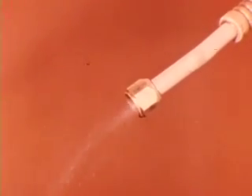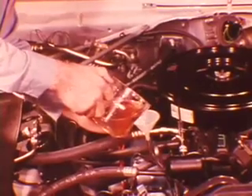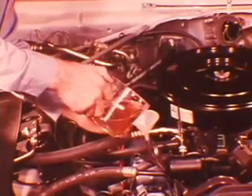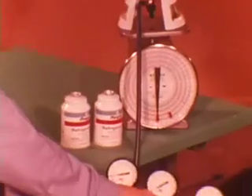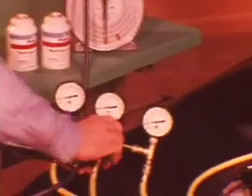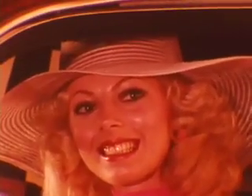After reconnecting all lines, add 10 to 12 ounces of new refrigerant oil. If the system did not need flushing, then only 6 to 8 ounces are necessary. After you've vacuumed the system and charged it with the correct amount of refrigerant, customers have different ways of showing their appreciation for a service job well done.